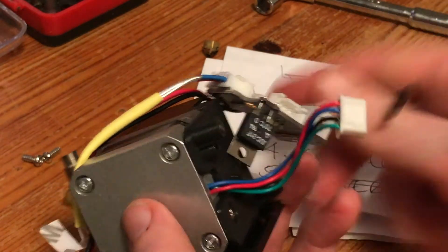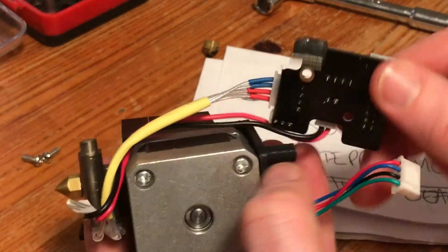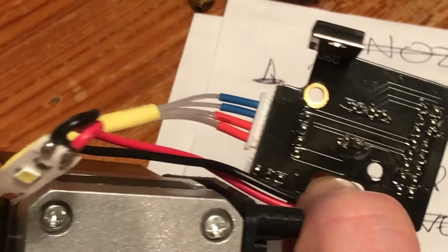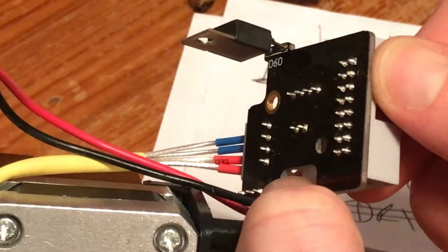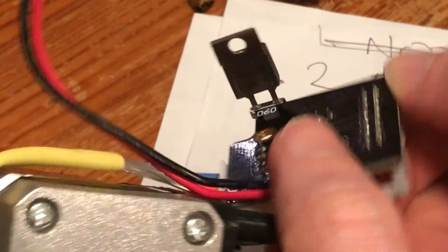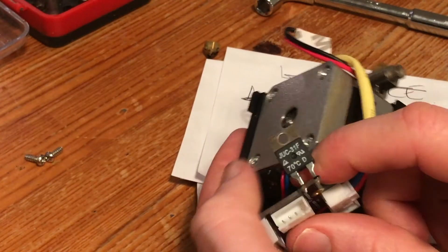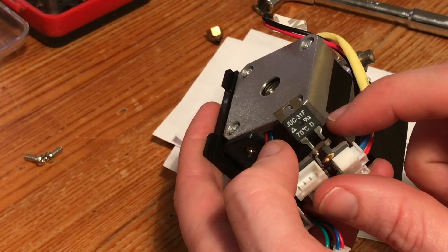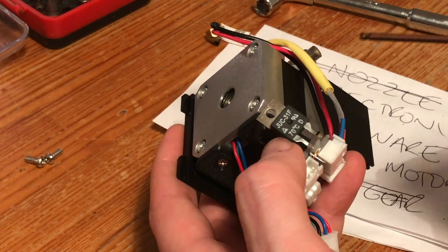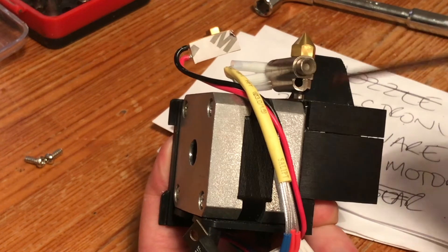All of this plugs into the interface board. Let's check the soldering — it looks pretty good actually. That's wave-soldered, machine done, not done by hand. That is good soldering. Here we've got what looks to be a MOSFET or something — marked JUC31F. I looked that up: a very quick Google found that this is a packaged bi-metallic thermostat, which is nice but critically absolutely nothing to do with the stepper motor. This witchcraft is all to do with the heat cartridge and the whole heat sensing package.